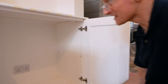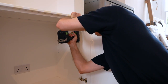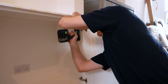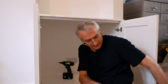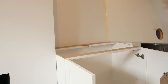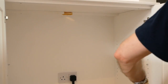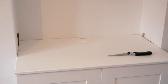At the risk of stating the obvious, you need to check your screw sizes quite carefully before you do this — the last thing you want is a screw popping up through the top. With the hole drilled and cleaned up, we can remove the tape and refit the top, adding a touch of paint around the inside of the hole. I also like to wedge the top in place, trimming the wedges back flush with the top.